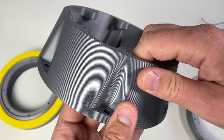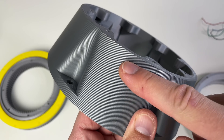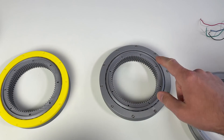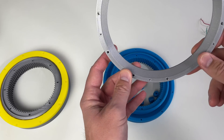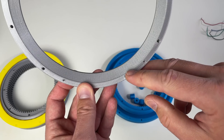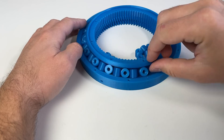I think the problem is because of the seams — these are points where the perimeters of the 3D printer start and end. Here the surface is very smooth, but here you can feel this line, and such a line on each roller causes the problem. In the current prototype, to solve this I put the option to place seams randomly in the slicer. But this option doesn't work perfectly — there are a lot of seams clustered here. Nevertheless, let's try to assemble it, put some lubrication, and maybe it will work.